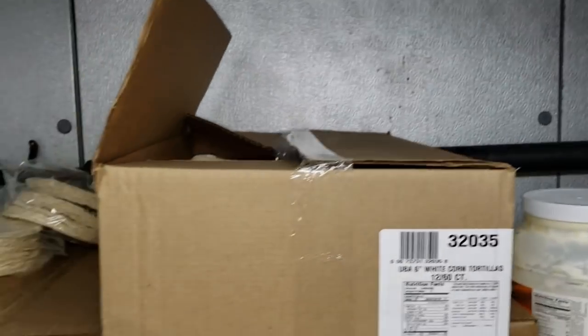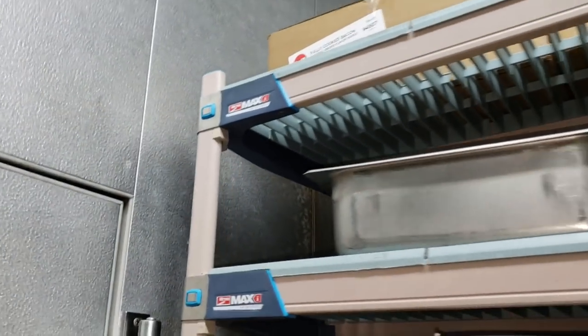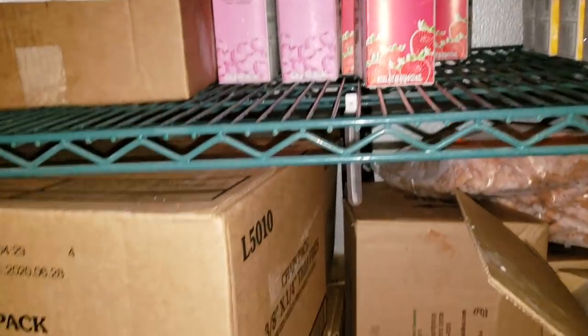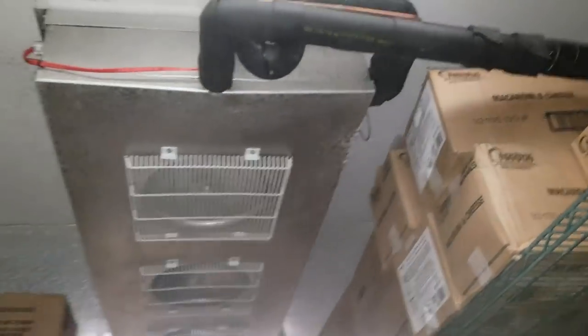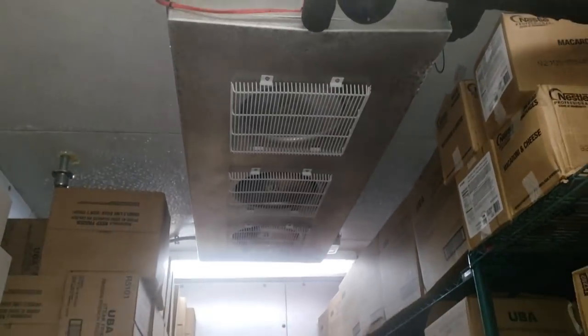To make it even worse, the drain line goes into the walk-in freezer and then leaves out of the walk-in freezer, so it's tied into the drain line for the freezer — which is not a good idea. There's my drain line right there, connecting and going down the wall and leaving right there. These factors make it very difficult to unplug this drain because it could back up into the freezer. When I try to blow it, I might blow the water into the freezer, which is kind of a pain.